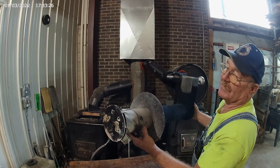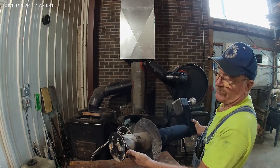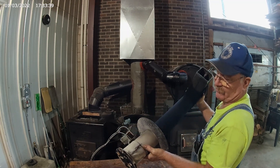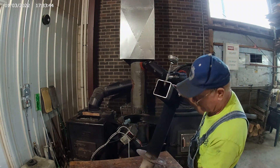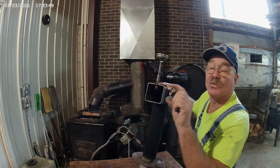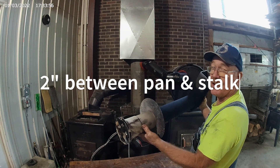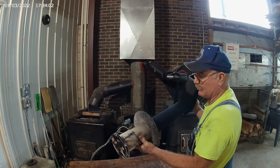You see how it almost looks like a miniature squirrel cage fan — and that's a three-eighths difference between the two. My son made this one. We also made this sleeve so that it would slide up and down the stalk, so you can get the very proper distance between the stainless steel bowl at the bottom and the end of this sleeve. We put a little tack weld on there and kept playing with it, moving it up and down, until we figured out we had it in just about the right spot.